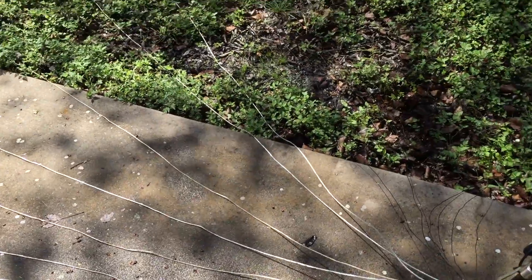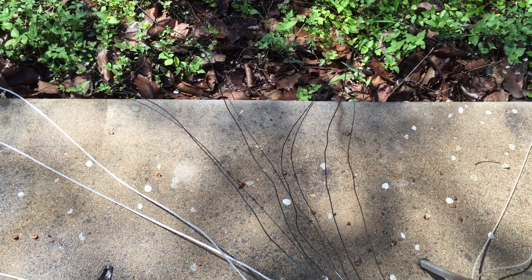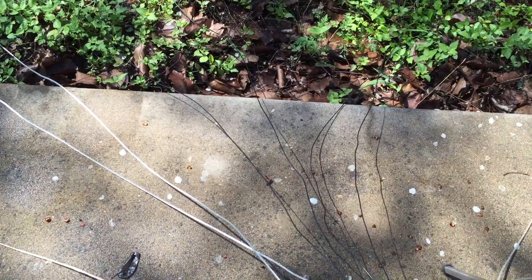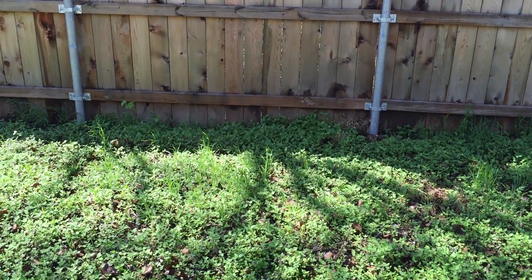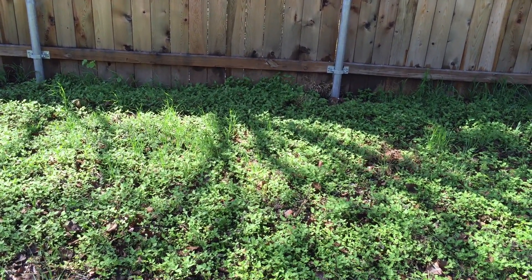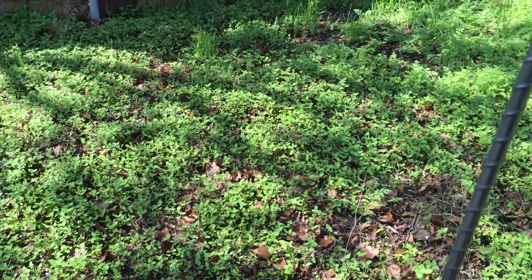There's a wall right here, so I just have one going to the wall and then going around — that should be okay. And then I have the previous four solid-conductor, about 22-gauge radials going out toward the fence, which is closer than the 17-and-a-half feet or so that 20-meter quarter-wavelength radials require. So it's pretty well covered.